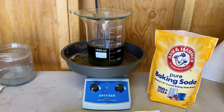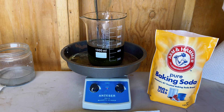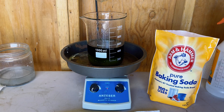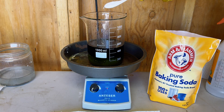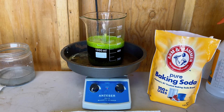It is now the following day, 16 hours since our last stir, and now we are going to add in our pure baking soda, which is sodium bicarbonate, and we are going to denox — otherwise known as neutralize — our copper nitrate solution. At this time I would like to remind you to wear your proper PPE: wear your respirator, wear your safety glasses, wear your nitrile gloves or vinyl gloves. Always protect your health and protect your life.